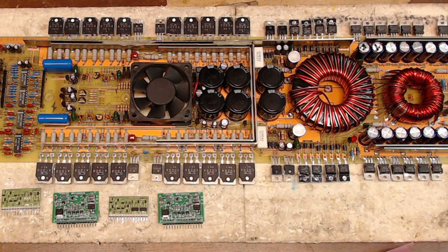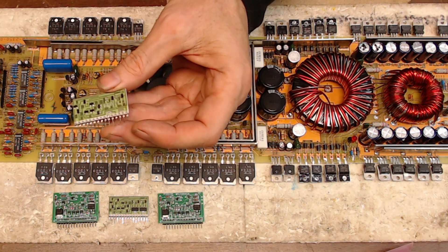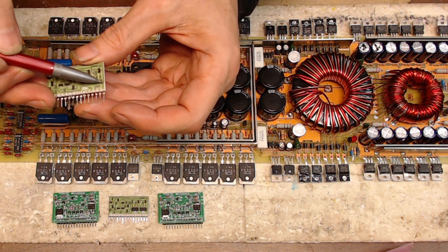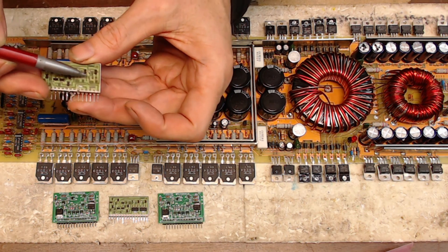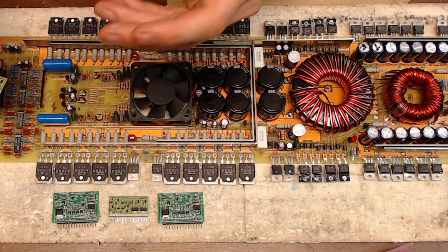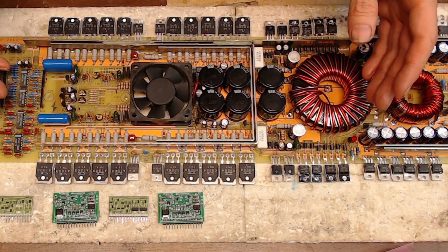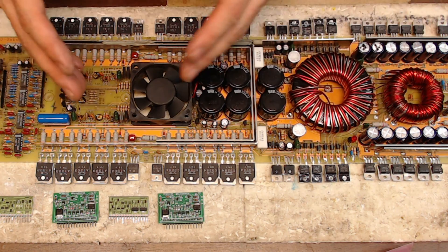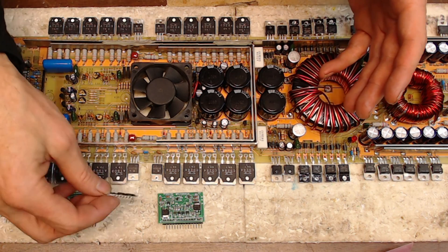I verified with the owner of the board. There are some cards that are available, but this card is damaged to a point where it blew open two of the resistor locations and two of the pads are actually missing on this card. I felt it was in the best interest of the owner to pursue a different avenue besides using the factory OEM cards.